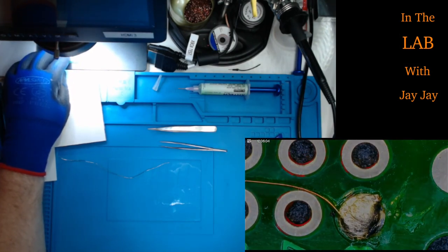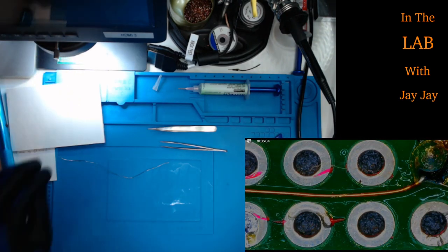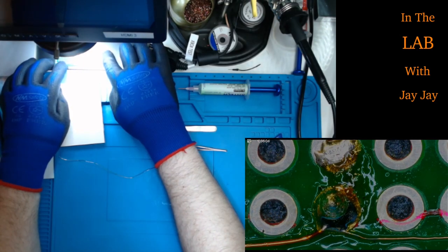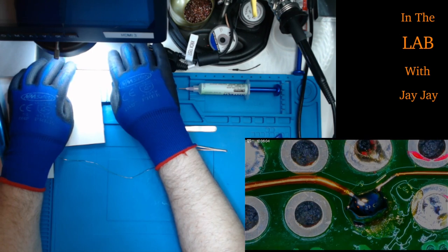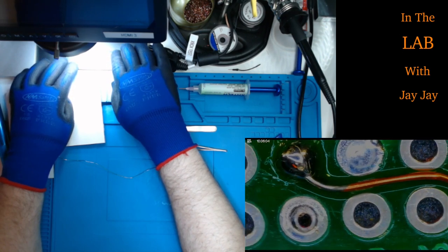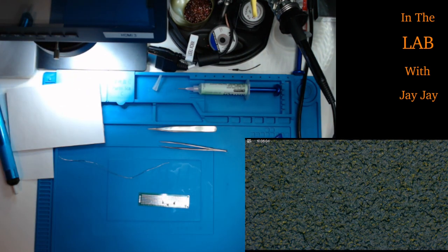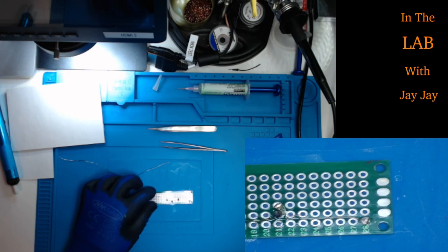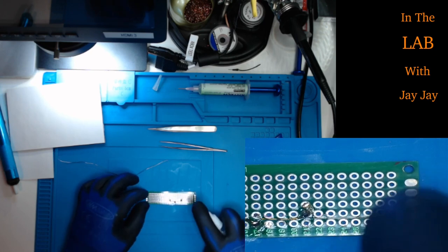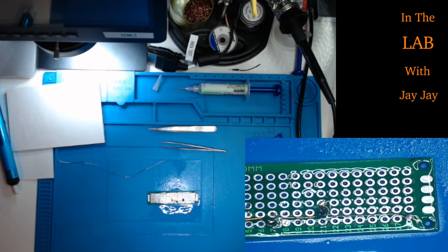So from the top, that guy looks pretty good still. Following along, that guy. There's a lot of flux still around, isn't there? But the joint looks solid. And that joint looks all right, but again, lots and lots of flux still there on the board, and that joint also good. All right, so we're going to hit them again with the IPA. And a Q-tip.